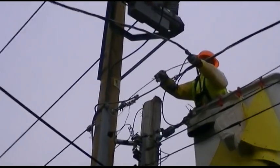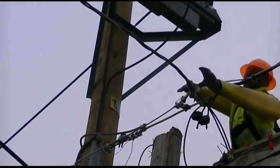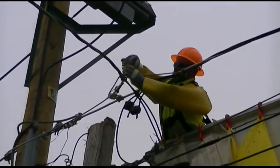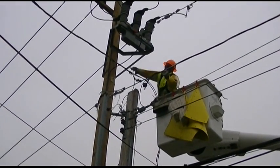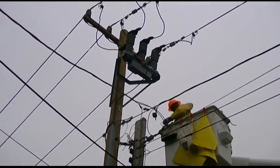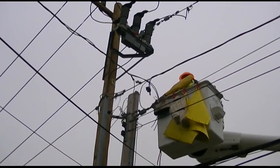It's been hooked up to the house, and now this guy is actually hooking it back up live, getting everything ready. I guess eventually this will be moved to the new pole, because they haven't done that yet. They're just doing the service for me because I asked. It's one-aught cables what they put on the house now, compared to number four, four-gauge. So we went from four-gauge to one-aught — that ought to be a nice upgrade. He's pulling everything tight, getting everything hooked up.